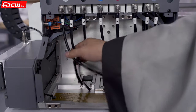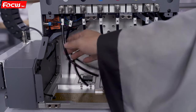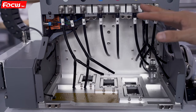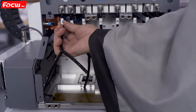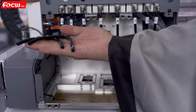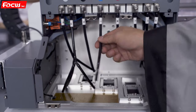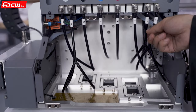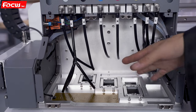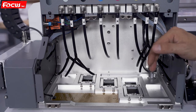When we take out the cover we can see some spare parts installed in the middle inside of the carriage. The first is the sub ink tank — for each color there are totally six sub ink tanks. First is white: two white channels divided into four ink tubes to connect with the white print head. Black is for one channel. Cyan, magenta, yellow, and varnish also have two channels divided into four channels to connect with the varnish print head.